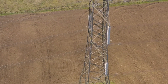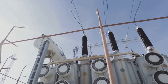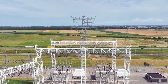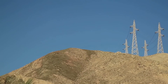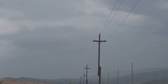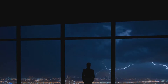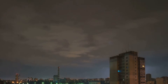The next time you see a lightning rod or think about a power outage due to a lightning strike, remember the unsung heroes — surge arresters, lightning arresters, and lightning rods. Surge arresters work within the power line protecting equipment from high voltage transients; lightning arresters do the same from outside the conductor, absorbing surges in the transmission tower; and lightning rods capture lightning charges before they can damage transmission lines. Despite their cost, these devices are invaluable in maintaining the reliability and longevity of our power systems.